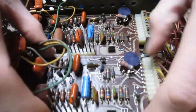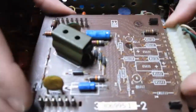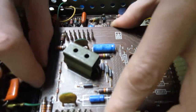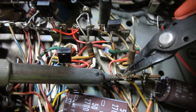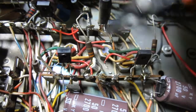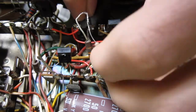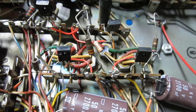Set the pot around the halfway value. Now reinstall all the boards and connectors. Moving back to the driver output section, you can see I am now swapping out the old resistors with new values that were calculated based on a guide I found. In this case, 10 times the original value works okay, and you now have a 330 ohm and a 750 ohm resistor in place of a 33 ohm and a 75 ohm. These should be rated at one half watt.